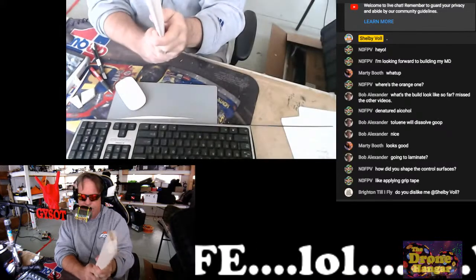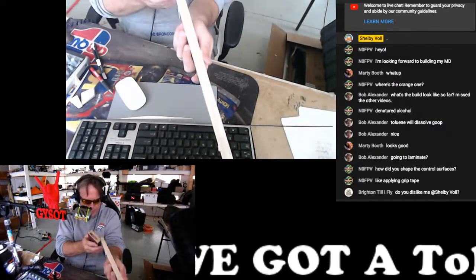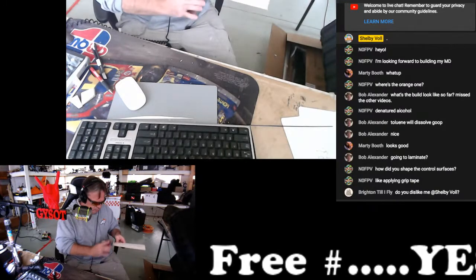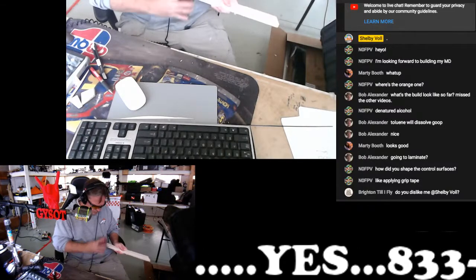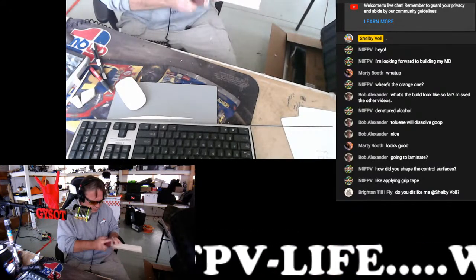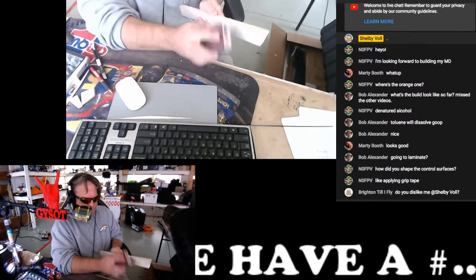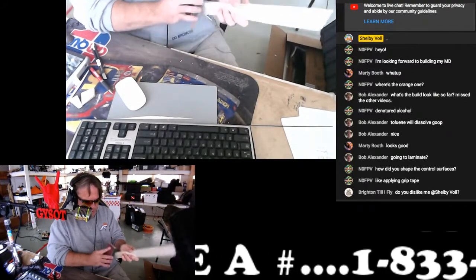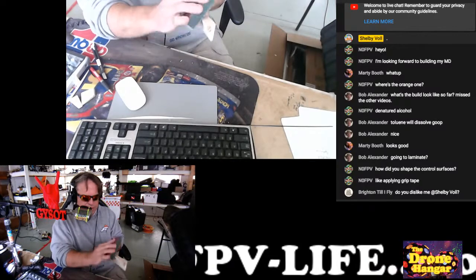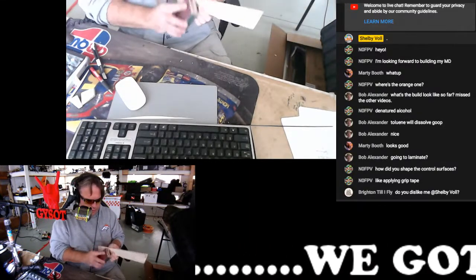If you want, you can get a handheld electric sander, or do it the old school way. You're going to round them evenly. You'll be going from one side to the other in the beginning. Just make sure you're paying attention. You won't start rounding all the way from side to side yet. You've got to create a nice smooth transition. I'm using like a 60 grit. I don't want to be here all day sanding.